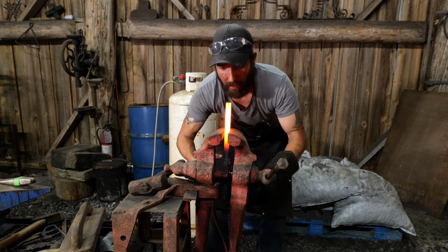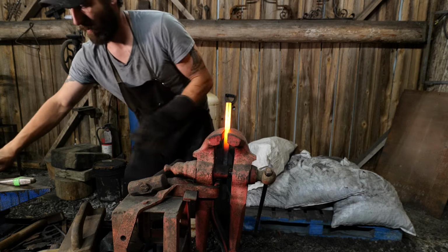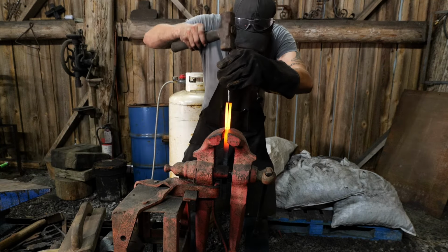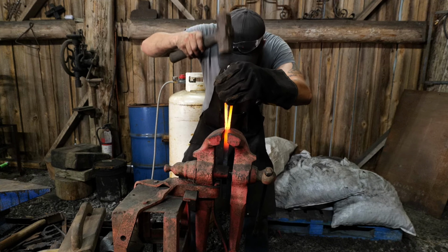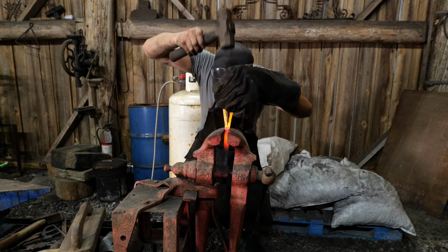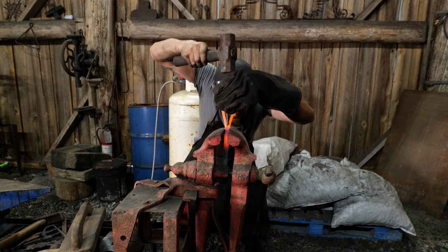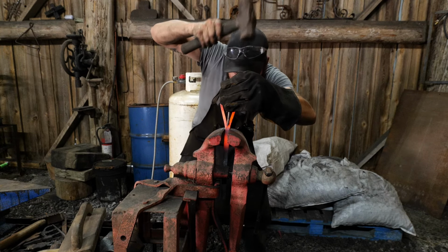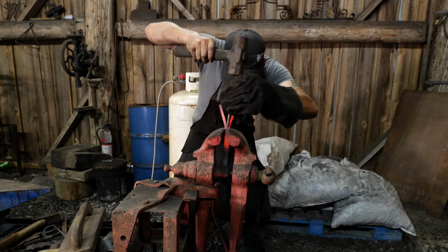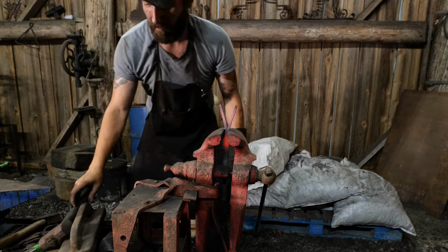First step in this process, this is just like any sort of squirrel cooker or any type of forks, grilling forks or things that you might do. We're going to go ahead and open up this cut using a nice long slitting chisel. We're trying to open it all the way down to that nice 3-inch mark, or get pretty close. And then we're going to work the chisel to the left and right to get this thing spread out a little bit more, hopefully without any galling. That's good enough, Thomas. We're going to open that up more later.